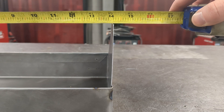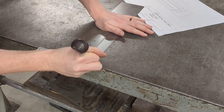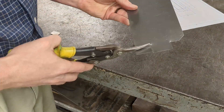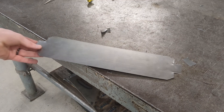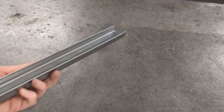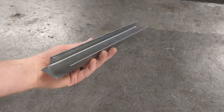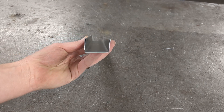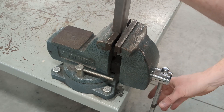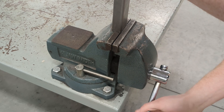Measure between your two ends before cutting your metal to size — that length should be right around 14 inches. Once you have the right size piece, follow your plans for the layout and cut your metal to shape. Head over to the brake and bend and flatten your hems first before bending your sides up to 90 degrees. The tab is the last piece to bend — clamp it in a vise and bend it by hand to 90 degrees.